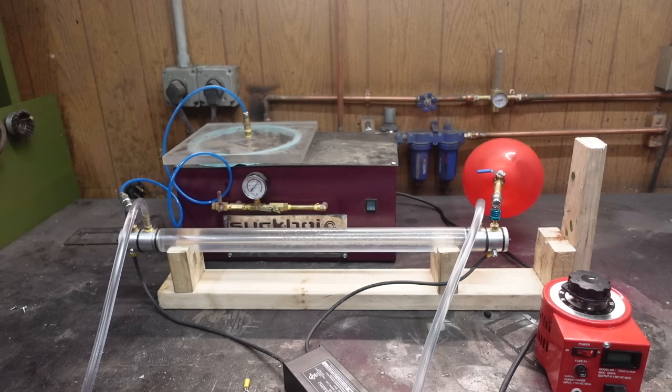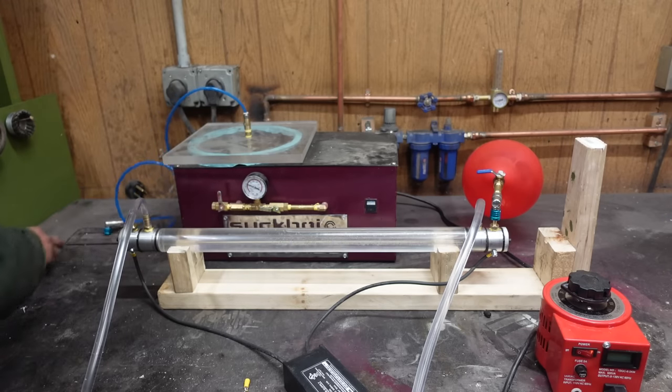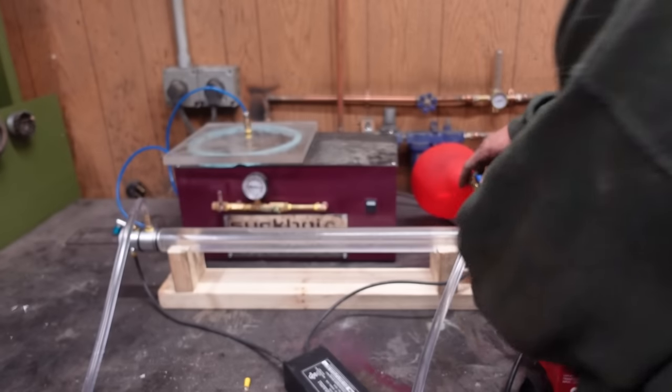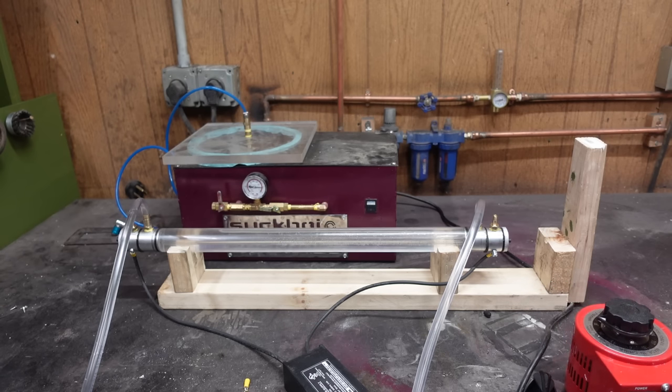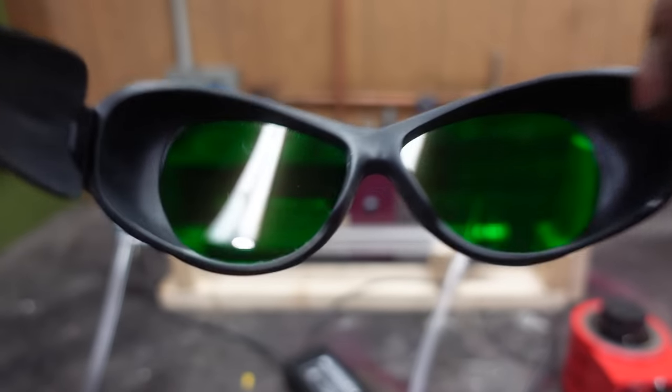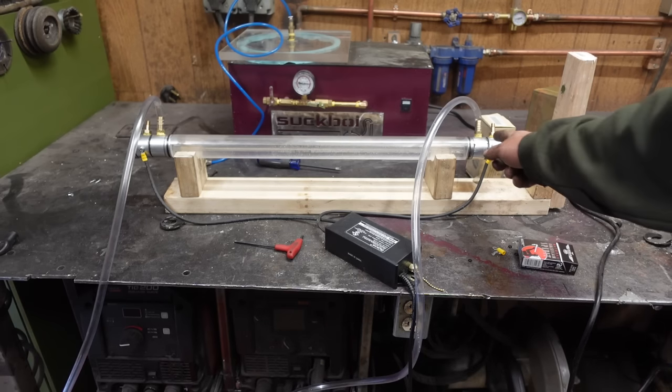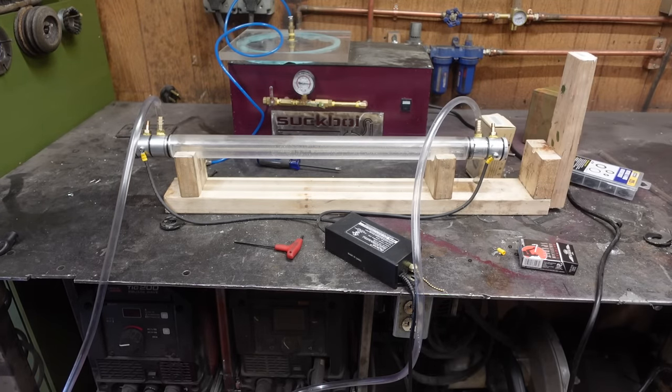Let's do it! We're going to let the vacuum pump run until we hit the maximum, which I think is around 27 inches of mercury. We can check that it's pressurized in there — I'm going to try and turn it on without running the water first, but only very briefly. Laser goggles on. Starting the variac very low, one arm behind the back. I don't see anything — I think we have a small leak. I've pulled off the insulation between the two machined parts. This is full power — we're arcing out to the water caps, so the current has just been running through the water this whole time, probably making a lot of hydrogen gas in there.